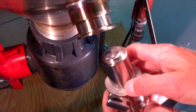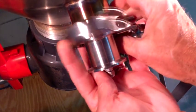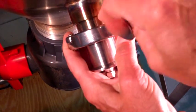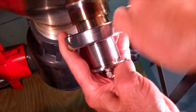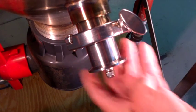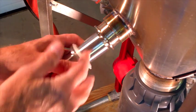First, a gasket is placed on the front of the AirSweep and the AirSweep is inserted into the mounting coupling. Next, a TriClover clamp is placed over the mated flanged ends and finger tightened. It's important to note that the mounting coupling has been welded flush to the inside of the bin wall. When the AirSweep is inserted and clamped in place, it will align properly inside the bin to allow the air pulse to sweep the inside bin walls.